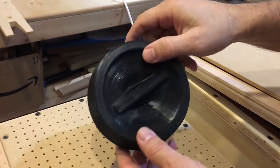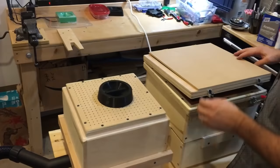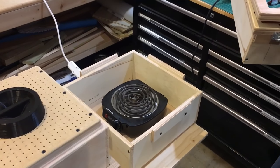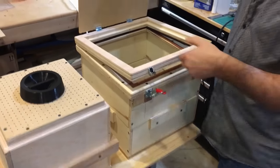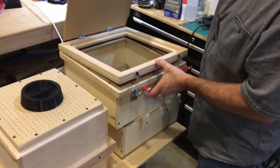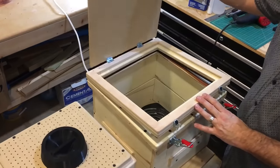You want to provide relief holes in the mold for the air, and an inset bottom area so that the air can actually get drawn through the piece and through the holes in the platen. Then I have a frame which I'm going to clamp the plastic in. This frame gets set over a heating area — I just use a simple hot plate. I put it over this until the plastic gets to the right temperature, then I drop it over the whole assembly with the vacuum on to suck it down. I also made this top cover just to facilitate even heating of the plastic.